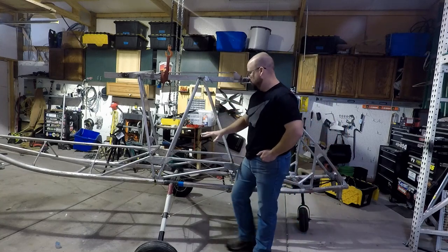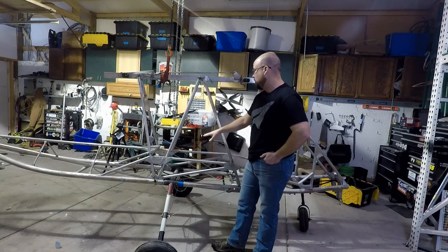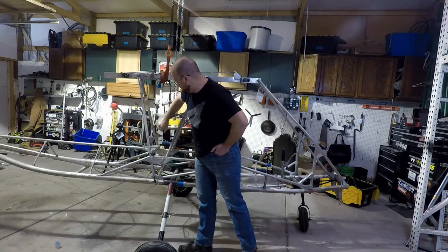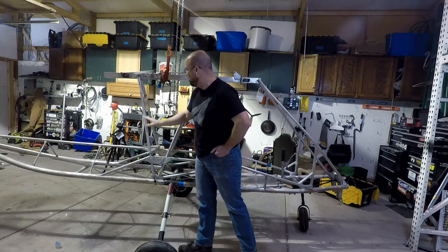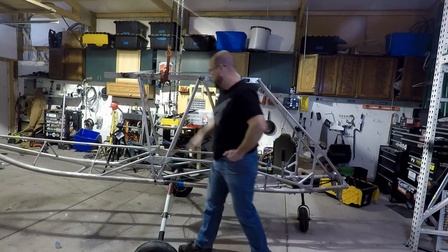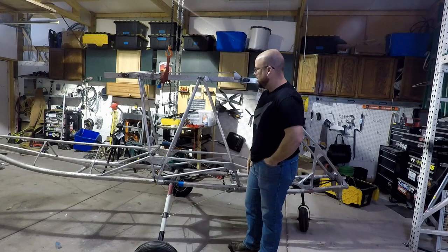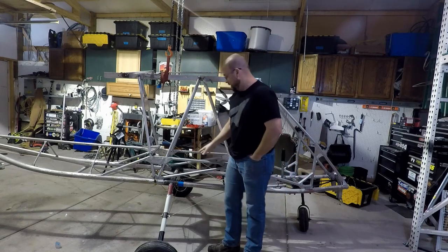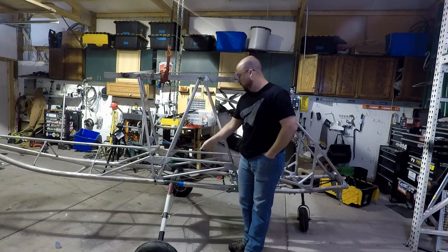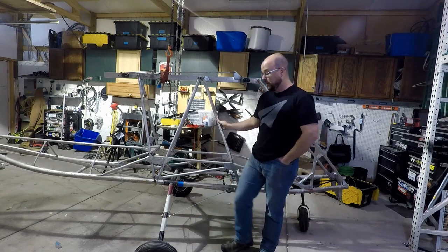This actually checked out. Had to do some repair work in here for loose rivets, and in some cases had to go to oversized rivets. Replaced several down tubes, and then also these ones, being the biggest one, so took all this apart and riveted new down tubes. All that I got directly from Quad City, the manufacturer. And then the big one that took quite a bit of time was the landing gear weldment on this side. Cut that off. I welded in a new trunnion for that. Upgraded to the fiberglass landing gear.